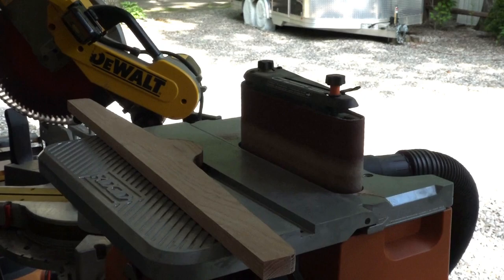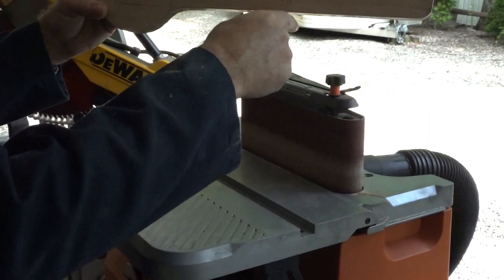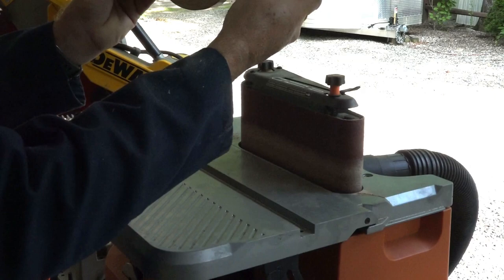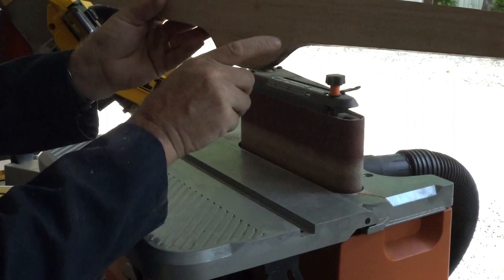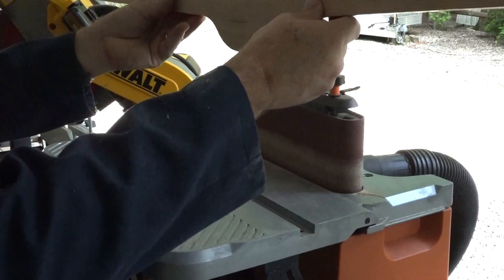All right, what you're seeing, this is going to go on the back of the display case, and there'll be a bolt. Here's 16 inches. There'll be a bolt going into the wall with a head on it, and the display case is going to rest on this. Now, if you want to get it level, you can slide it one way or the other on these ramps, and it's designed so if you slid it all the way over to here, this bolt won't come off the edge, it'll stay on. So that's what this hump in the middle is for. It's designed so that if you slid it too far, it would never come off. And you can slide it one way or the other on these ramps, and it'll level the display case.